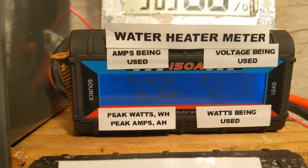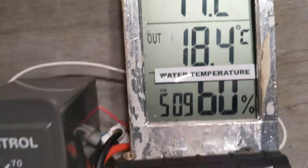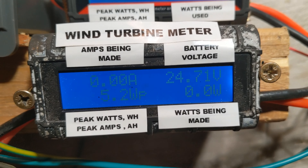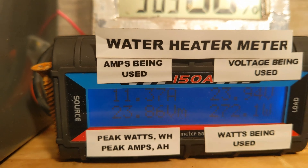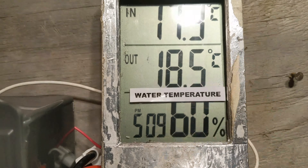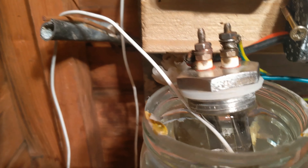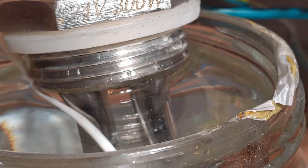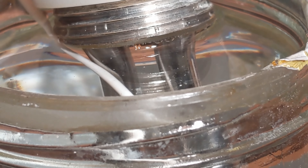The idea is when the turbine is making power, I can set the water heater — set this thing — to use approximately the correct amount of power. I know you won't be able to tell exactly. I'm just going to crank this up a minute until we get a change in temperature. It's 18.4. The battery voltage will start going down. This is what the water heater is using: 272 watts. It's gone up to 18.5. There's a bubble or two already.